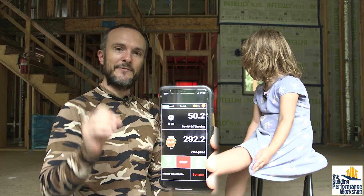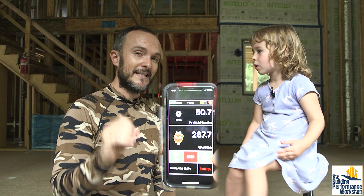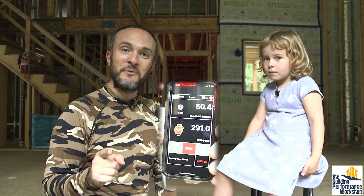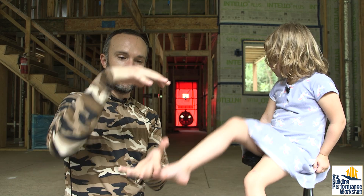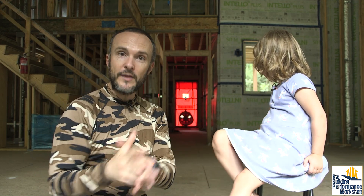So Nanette, which way were we blowing air through the blower door? Out. We were blowing it out just now. And we also want to flip it around and blow air in. Because that way you're able to compare those two numbers — the goal is for both numbers to be exactly the same. And that is in fact what we see in this house, which means the leakage pathways are the same in all seasons. That means we have utter control from top to bottom and all four sides in both cold weather and warm weather.